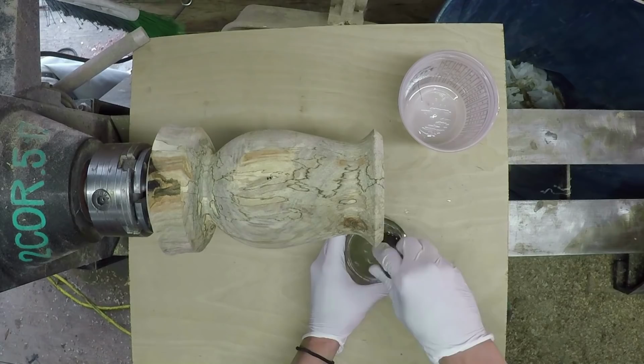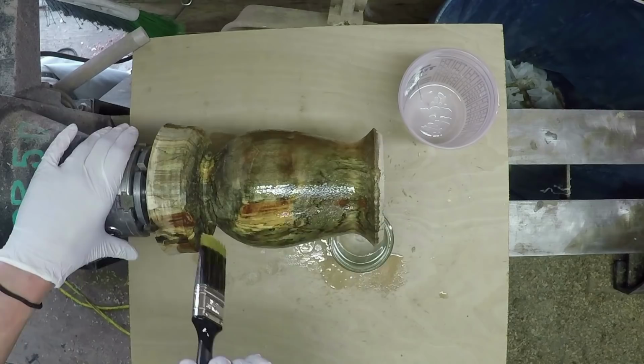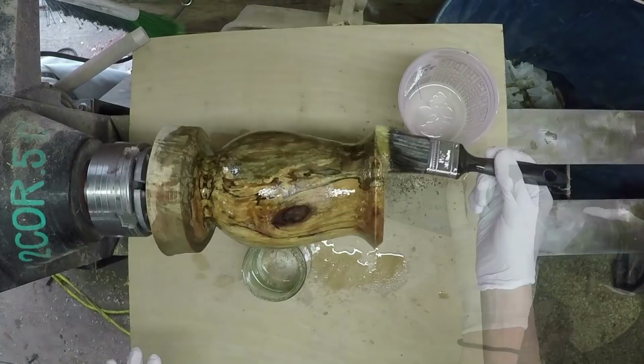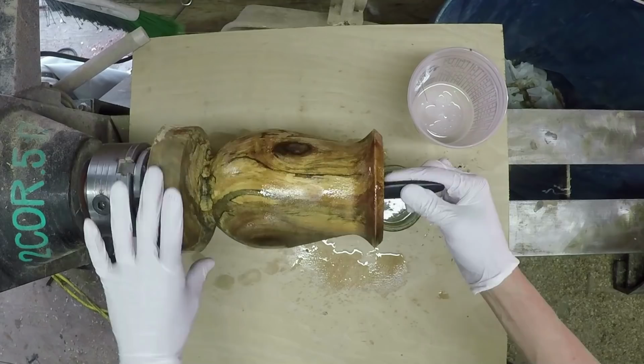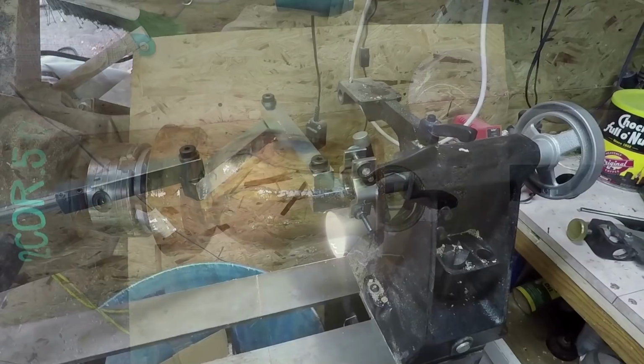And then however much resin you use, put that amount of acetone in with it. The acetone helps thin out the resin so it goes deeper into the piece and soaks in really well, and then it will slowly evaporate and leave behind just the hardened resin. So it's not like a vacuum chamber, but it will suffice for pieces like this. So that's what I'm doing here. I'm just doing the inside and outside really well. I let it sit overnight and it was ready to go by the afternoon, about lunchtime, so less than 12 hours.